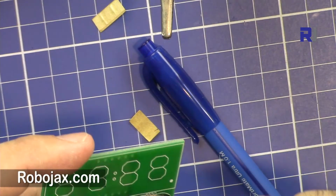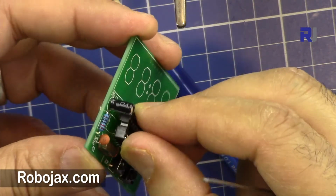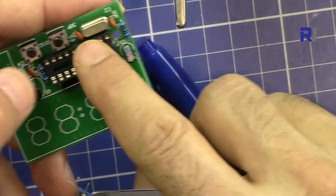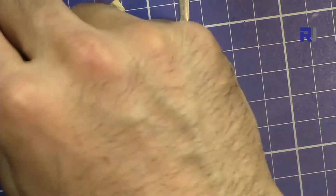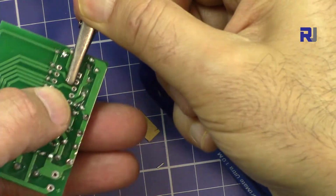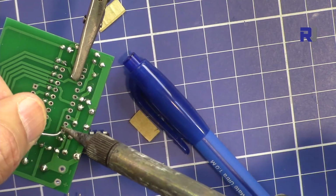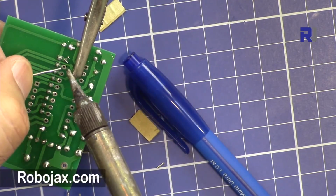I have to bring it closer so I can see it. Now one of the pins is not straight, so I'm just pushing it a little on the left side, so it's inserted now. So the socket is now in. Now I will use the holder, so it with a crocodile clip will hold it for me, and then I'm going to solder this all. So one side on the left, and then one on the other side. So diagonally just solder those first, so the socket is in place, and then after that just start soldering them.